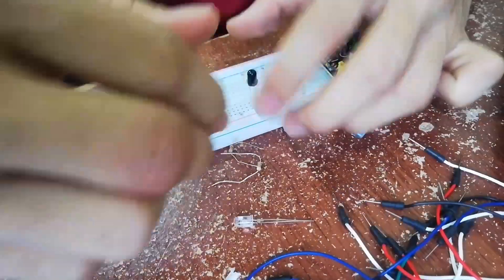We did a test to the sensor to check whether the sensor is able to function correctly or not. Unfortunately, we failed the first attempt of the test as the LED kept lighting up even though the sensor was placed at a dark surface. To find out the problem of the unsuccessful test, we tried to test the black and white sensor by placing the photodiode and the IR LED far and near with each other.